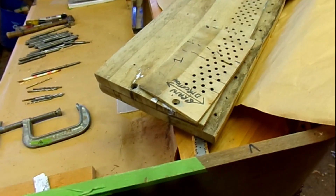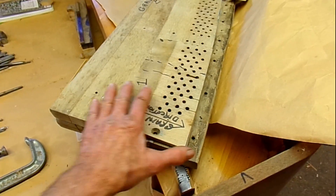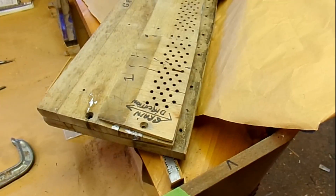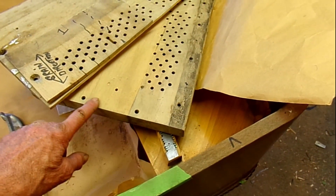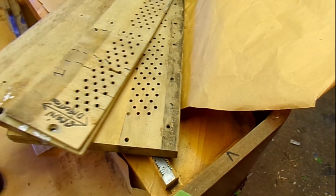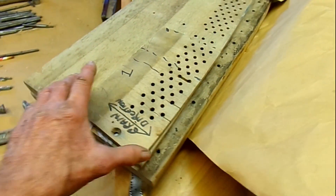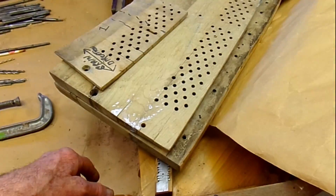Pin block, 33B. Pictures tell a thousand words and movies, millions of words. Here's what we have: this is the old pin block, part of it. This is the base. We now replace it with a multi-laminate block, which is probably better than that — no doubt, more stable. And we made this piece new, also with another multi-laminate pin block. It took two pin blocks almost to do this. We glued that to there, and now what we're working on are these pieces — and this cap piece, which is the most important to put on.